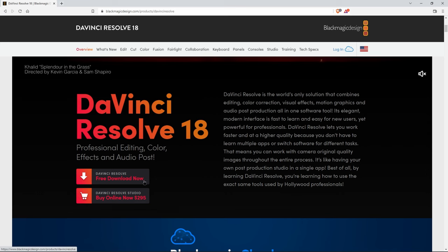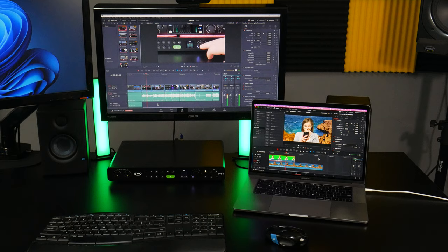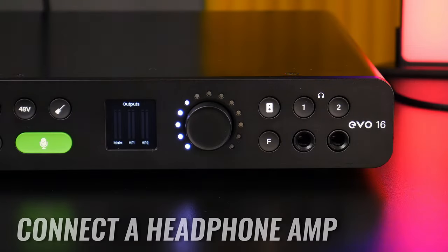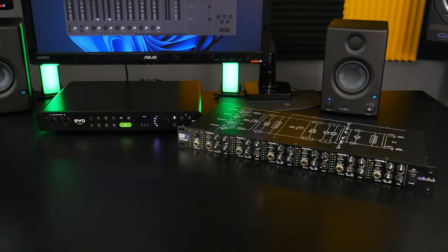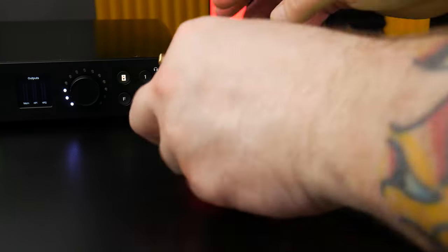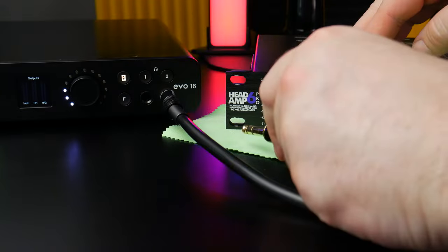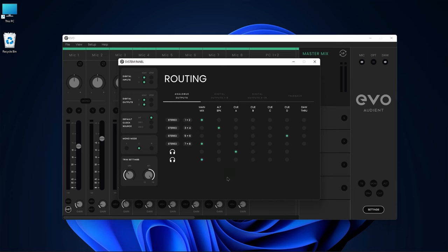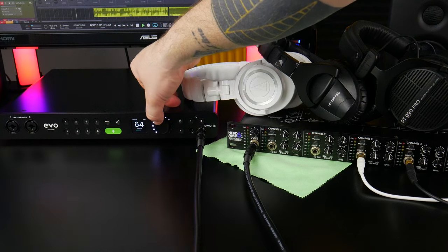The EVO 16 has two independent headphone outputs, but perhaps you need to add more — in that case, connect an external headphone amp. The exact way depends on the amp you have. Some smaller ones only have a direct input: connect a single TRS cable to a headphone output on the EVO, connect it to the direct in on the headphone amp, set up the source for your headphone output in Routing, and make sure you turn up the output. If your headphone amp has left and right inputs, connect quarter-inch TRS cables to outputs 7 and 8 on the EVO and run them into the headphone amp. Links for quarter-inch TRS cables are in the description — Monoprice at about $15 for 15 feet, or HOSA Pro at about $19 for 15 feet.